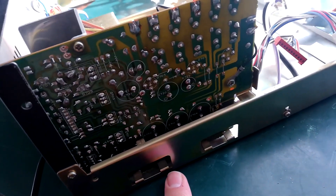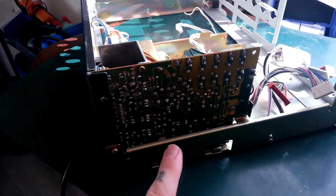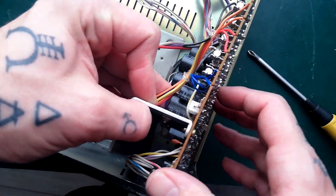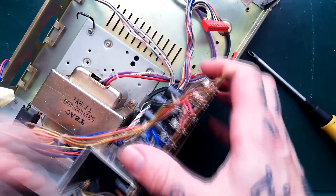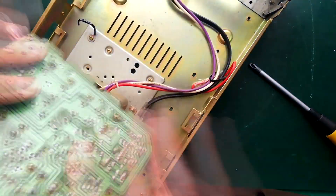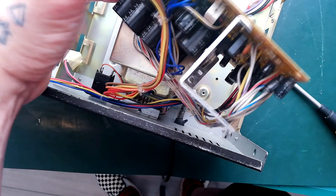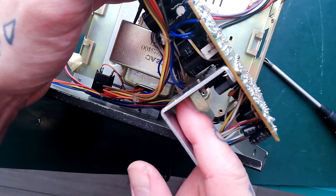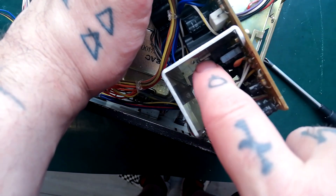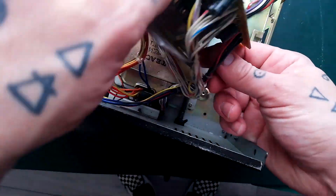This one by the way is just the standard short brass screw I've been putting in my pin compartment. With those two screws out it's still a tight fit to get the board out. Those two screws are what hold this heat sink for all the voltage regulators in place. There's some sort of thermal paste on these and a little plastic layer between that plate and the heat sink — they obviously don't want current conducting to the plate. You could probably just about reach in and get at these caps for a recap.